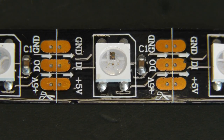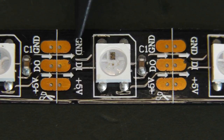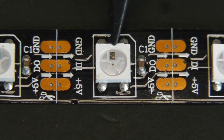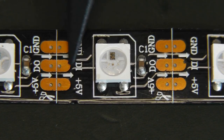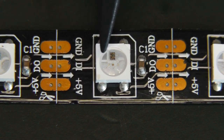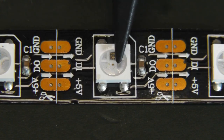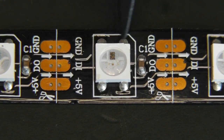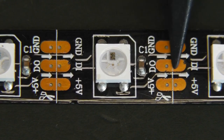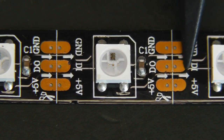This is a closer look at the WS2812B RGB LED. You can see 1, 2 and 3 LEDs for red, green and blue. On top of it you have a small integrated circuit which is there to control these LEDs. To control them you just send data over the data-in pin, which gets processed by this integrated circuit. This sets the duty cycle of each of the 3 LEDs, controlling the brightness and therefore the color. Whenever you send more data over data-in, it will relay it over data-out, so you can chain LEDs and control the next one.